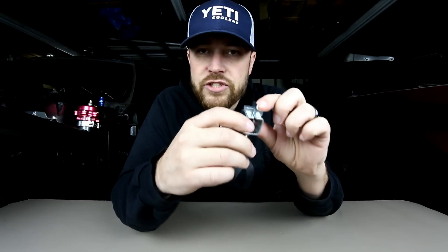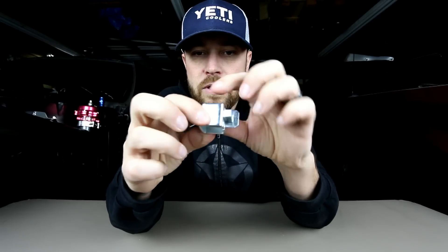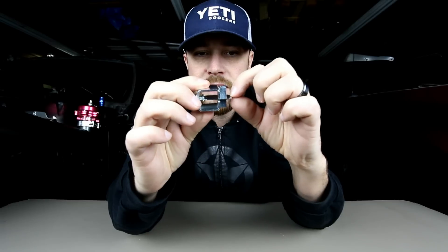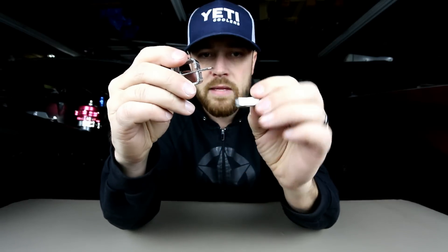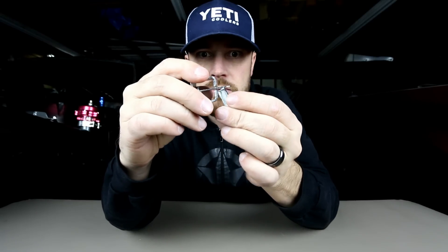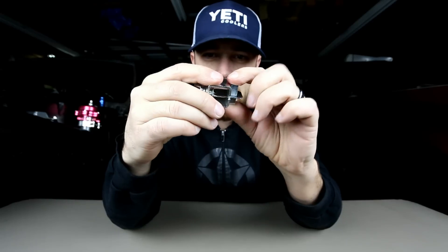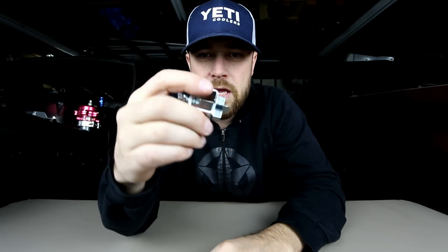The butt clamp is mainly used in sheet metal work. It's a very simple tool, easily engineered. It's devised of a wing nut, it's got a threaded bolt in the middle with a small thin plate that goes through, and that thin plate has a square hole in it with a square peg that goes in that hole. You can actually clamp two pieces of sheet metal together in very close proximity in order to weld.